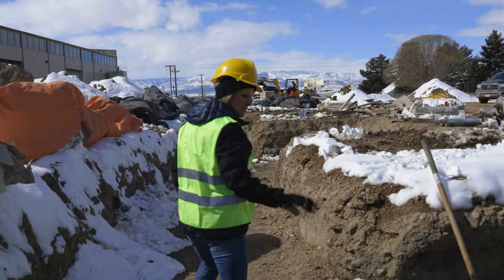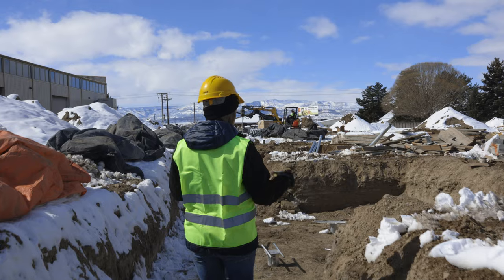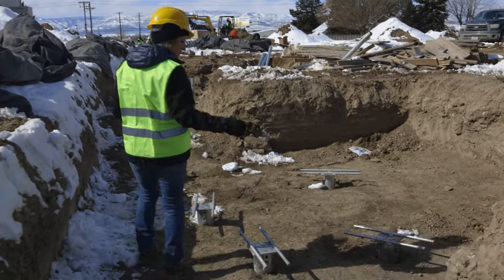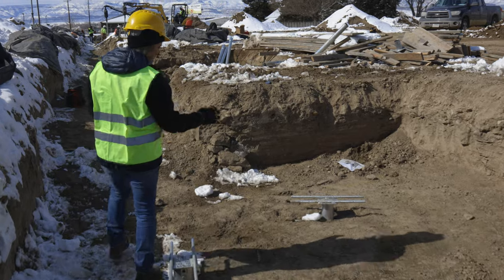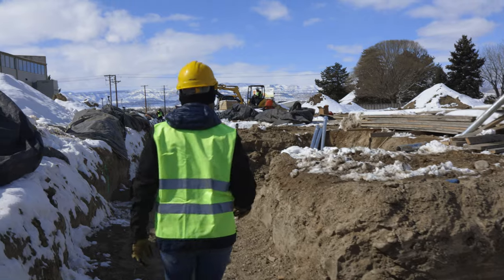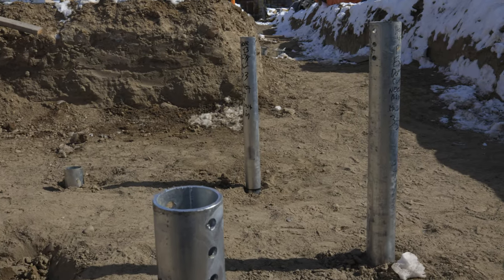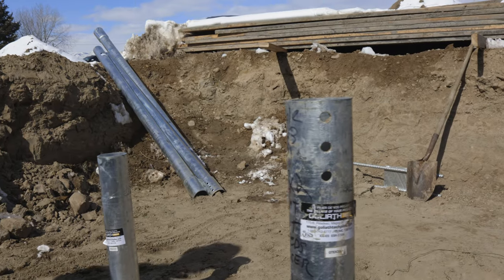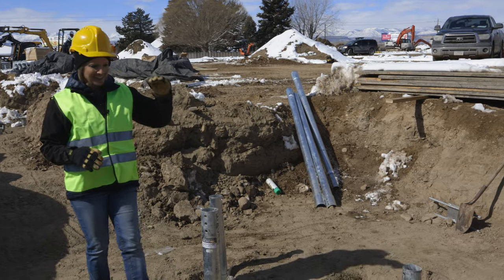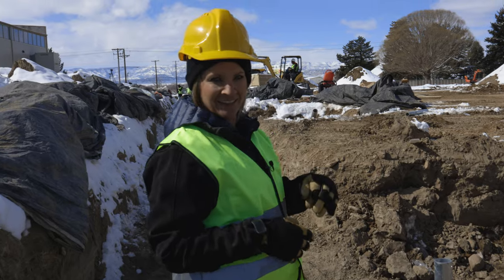You see we have a different amount of piles in each location and different positions on each location as well. Some were a little bit closer together, and here, based off of where those posts are coming down, they're a little bit further apart. This one was finished earlier, so we've got different piles, and you can see they've ended at different lengths and each one has a different height. That height is dependent on where they met that torque — when they met refusal and hit the torque.